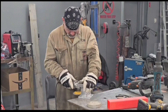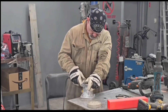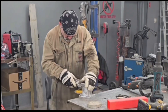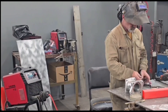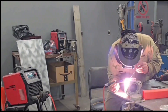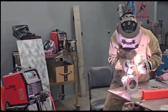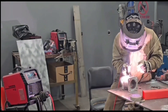Now with the burr bit and the sanding pad, I treat this stuff with beeswax — and I say that over and over again on the channel because there is not a better trick in the world on your abrasives on aluminum. Aluminum will gall up your abrasives, but if you use beeswax it saves you so much and works so well that you really need to use that trick when you sand and use burr bits on aluminum.